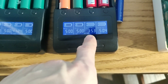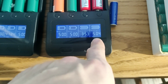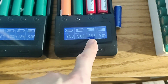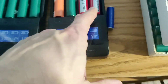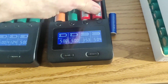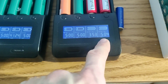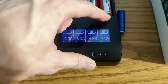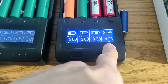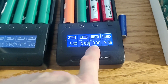This battery has 350 milliamps and that one has 500 milliamps. I'm actually surprised about that, but it's possible it's been used. The ones I've had in the past also had about 500. They'll tell you it's got 3,000 milliamp hours and yet they're only 500, so these will die pretty quickly. And if you look at the resistance — that's ridiculous. You want things in the 20s or 30s, and this is 400 and 300.